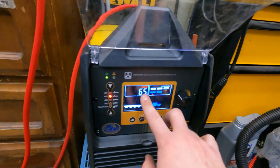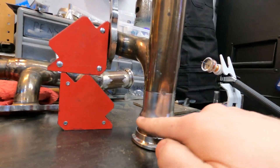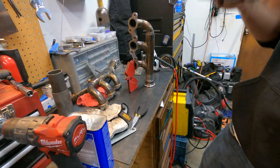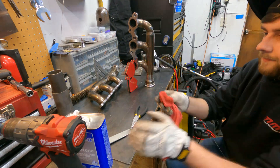I might need to turn that amperage down just a little bit, but we really shouldn't have any problems. I'm going to first start by adding probably some more tacks, just working on either side, because I don't want to warp it. I don't want to get it too hot. Might even just let it cool down extensively and then work on it.